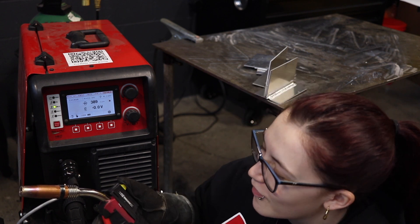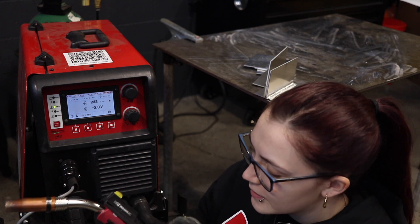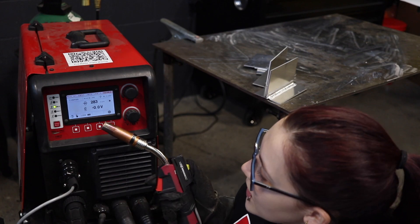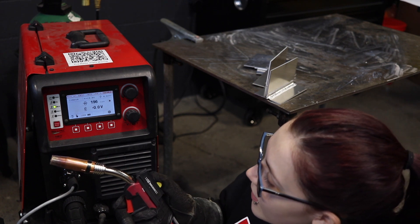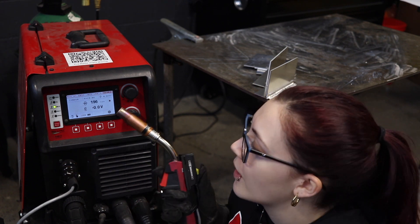When I weld with a slider on the gun, Pulse Aluminum, I always wear a TIG glove on my hand that's going to be holding the gun because I have more dexterity. The thinner leather means that I can feel the slider better. The same way that you don't want to stomp into a TIG pedal, you don't really want to yank this all the way back. You can move very slowly. If you look at the screen here, you can see that when I pull back on the slider, all of my settings go down because we're in a synergic program, so they go down in ratio.